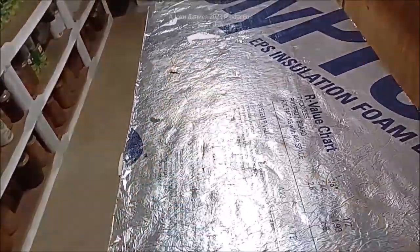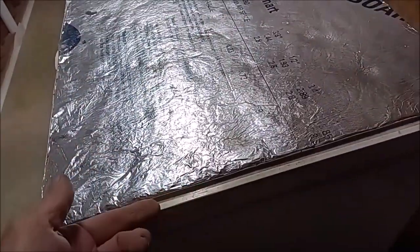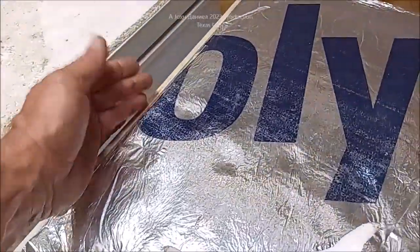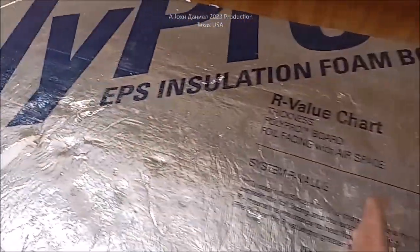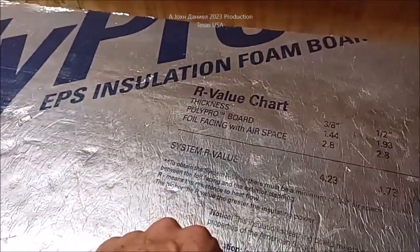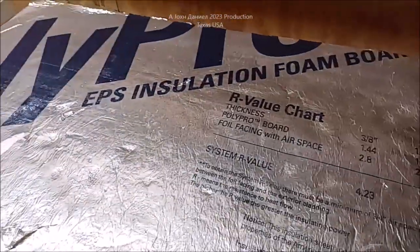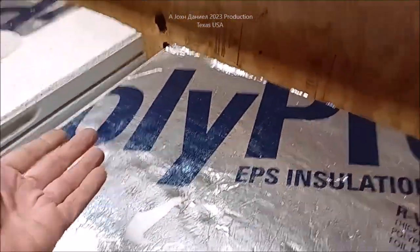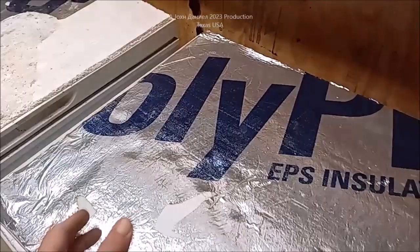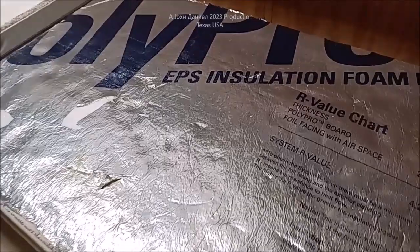This will come off and you can clean it with mineral spirits. If you want, you can trim around it with half-inch plywood — say three-quarters of an inch — with a few strips in the center. You can glue them on or screw them through the metal, it won't hurt anything. Then you can put this on top, fill the spaces to make a grid using one-by-twos. It's not going to add a lot of weight — this is probably about five pounds of lifting resistance.